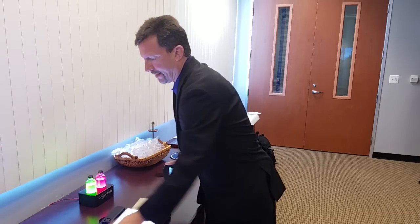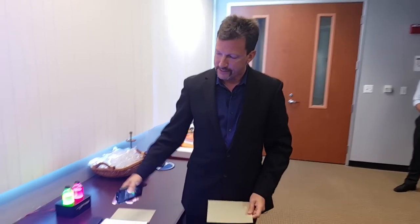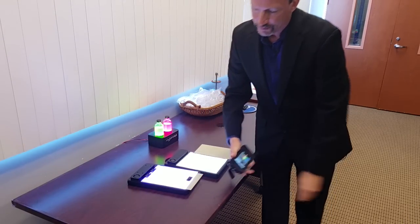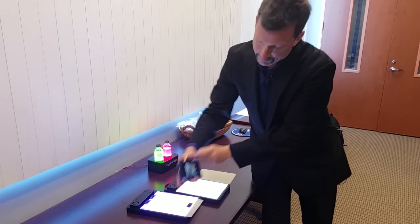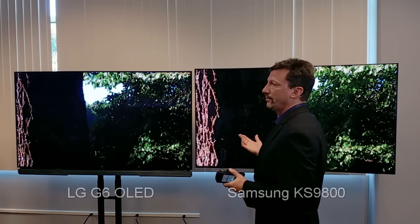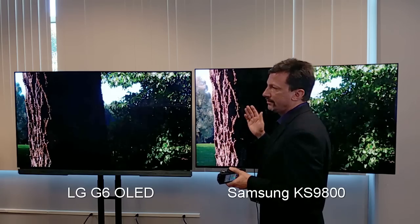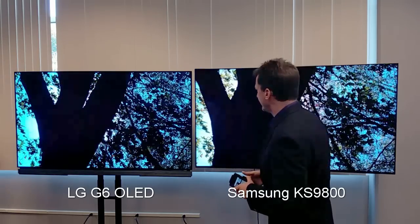By comparison, if we take a sheet of this quantum dot film and place it into a blue backlight system — the same blue LEDs as in a white system but just with no phosphor — and look at that white light, we have a very nice red, green, blue peak spectrum, which is very different and well-matched to exactly what you want for a display. There are test screens here, and I encourage you to come up and have a look — you can really see the difference in the color bands, contrast bands, and everything else that goes along with this technology.